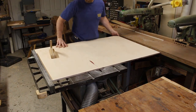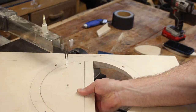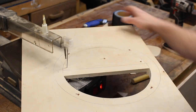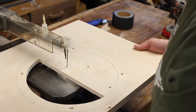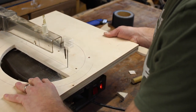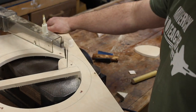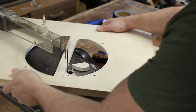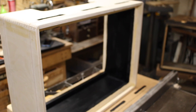Next I'm preparing the material for the baffle board. I started with half-inch plywood, but later switched to 3/8 inch plywood just so I had enough room to make sure everything fit with that one 12-inch speaker. I used the scroll saw to make a more accurate cut for the speaker opening. I also kept in the speaker protector — that vertical strip in the middle — which is a traditional Vox look. I used some black acrylic paint for the inside to finish it off.